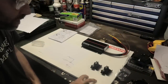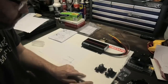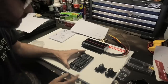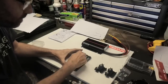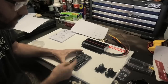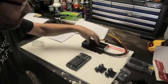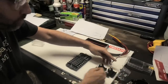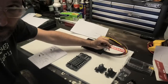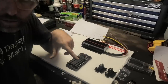I don't have the two-post terminals yet, but the positive will go to these two fuses, then the negative is going to come over to a negative bus bar. This is a Blue Sea Systems fuse box I've had for a while. The negative becomes a negative bus bar up here, and then the positive — once it's been through one of these fuses — comes to the positive terminal and we can run off to various devices, fused independently. Then the brown wire from the Redarc unit — our charge current — will go through a separate fuse, with this being our input fuse and this being our output fuse, then it goes back to the positive terminal to charge the house battery. The red wire goes off to the starting battery bank charged by the 24-volt alternator, and the yellow is the feed from the solar.